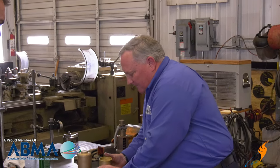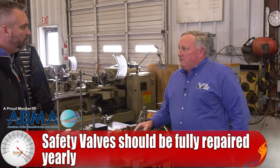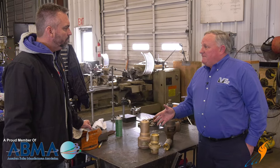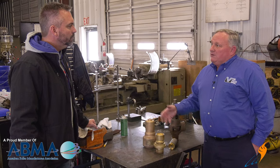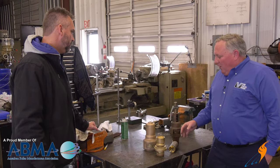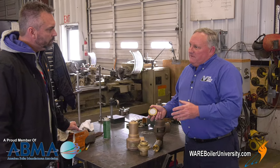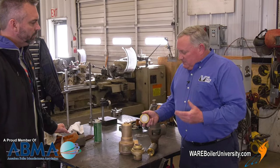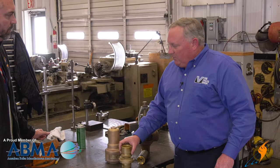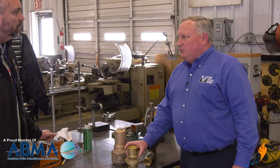Typically on a safety valve, we recommend taking them off the boiler and doing a full repair once a year. That'll keep the valve going for many years. It's not uncommon to get 30 or 40 years of life out of a flanged safety valve if they're routinely repaired. When we do a repair, we check dimensions on all the component parts and take them back to manufacturer's allowable tolerances, so the valve comes back to the customer pretty much as good as new. We put a VR stamp on them — they're essentially repaired to new standards.